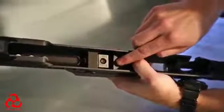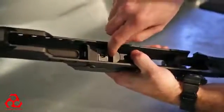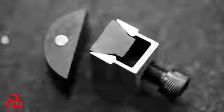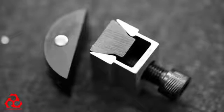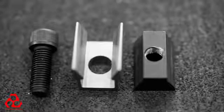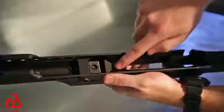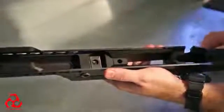This half-round is held in with a magnet — it's floating, just residing in this space. What it does is it adjusts for any angularity difference between your recoil lug and the chassis, thus eliminating any need for bedding compounds or bedding materials. This chassis is also a V-block, so it supports your receiver nicely.